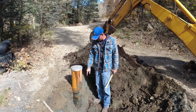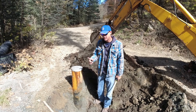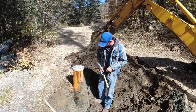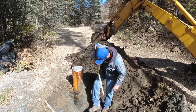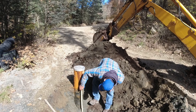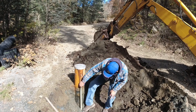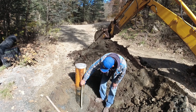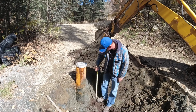So a well pump will be down there, comes up — I'll show you the pitless adapter here in a minute — but I've got to be 24 inches below grade. So we got in here, dug a little hole, and right there it's 24 inches, so I should be able to just dig a little bit out right here and should be good to go.